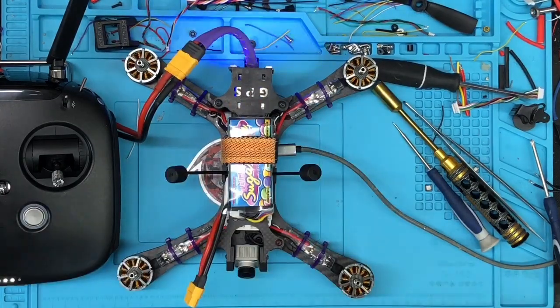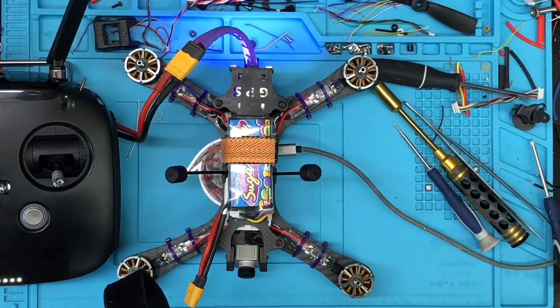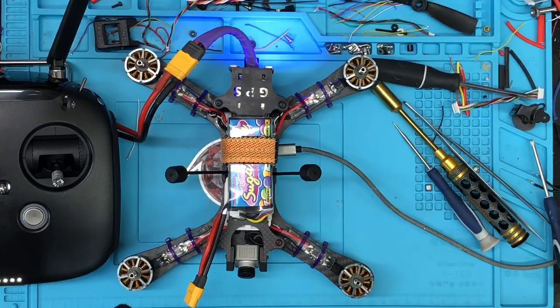Okay, so you have to go to your remote controller, and then go to your servo setup, which is the first one. And you see how there it says sub trim? Yes. Okay, so you have to adjust your sub trim. And what that's going to do is watch what happens. I see him moving. You're moving a roll right now. Yeah, I'm going the wrong way, though. So let me go down the other way, because I need it to get to 1,500. Okay, so there's a little delay there. But I need it to get to 1,500.